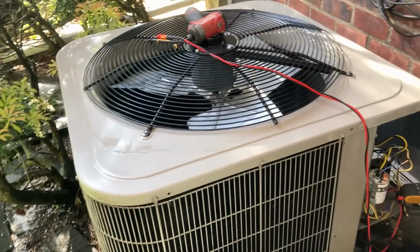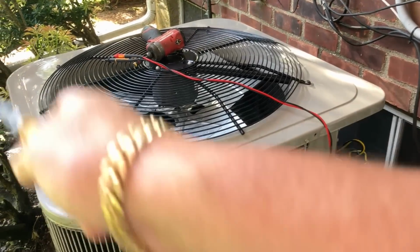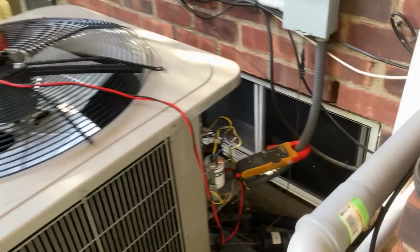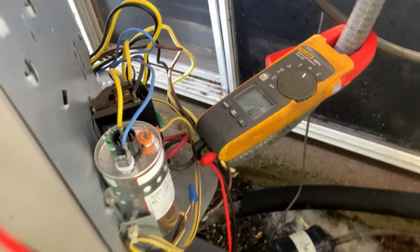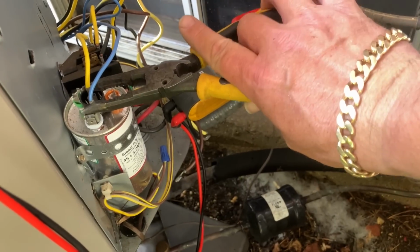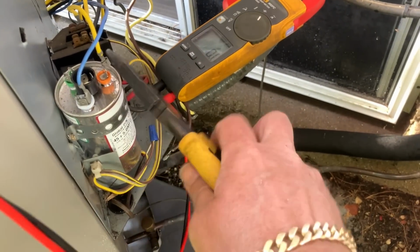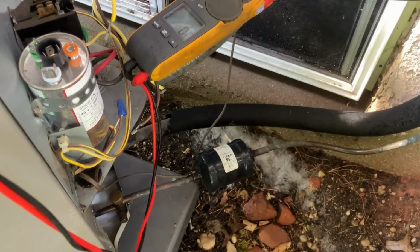All right, the condenser fan motor shroud assembly is back on top of the condenser. Resecured all the screws I took out. I didn't lose any. We're gonna check out the rating on the dual capacitor. First, I'm gonna discharge the capacitor by touching all the terminals together. And then I'm gonna take off the wiring that remain. The common, which is the yellow, compressor was blue.